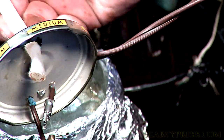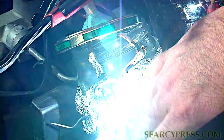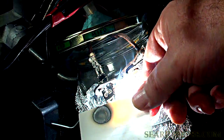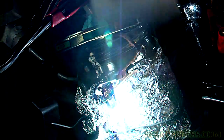This light bulb runs on about 14 volts DC, and it is imperative that you not run it below 12.3 volts. If your fuel cell lighting system cannot handle the load and maintain 12.3 volts DC, you're going to have to upgrade your electrical system on your vehicle. So that's our threshold: 14 volts, minimum 12.3.